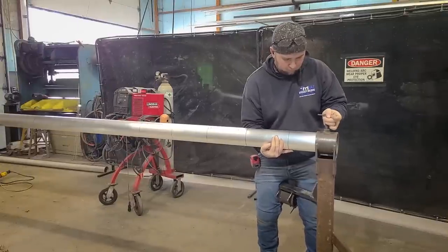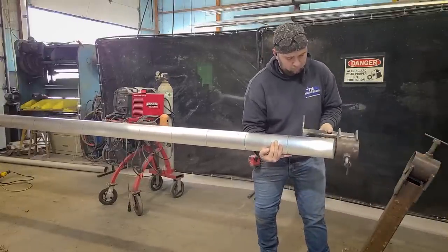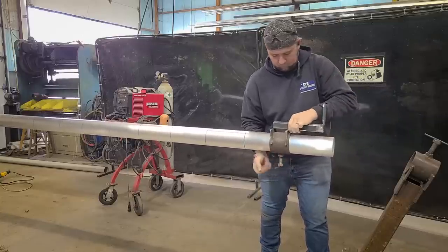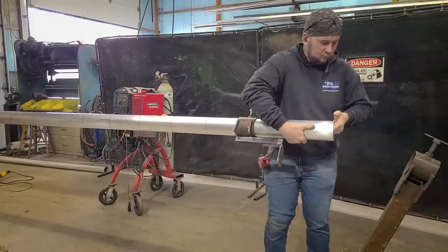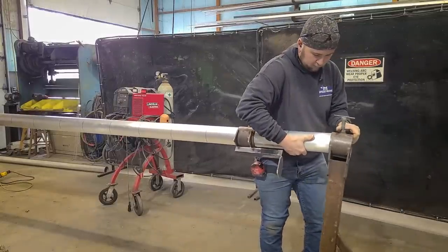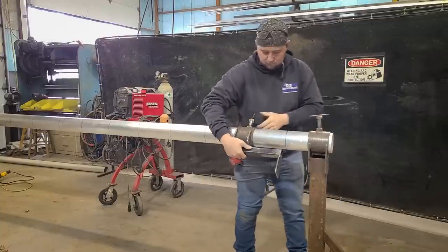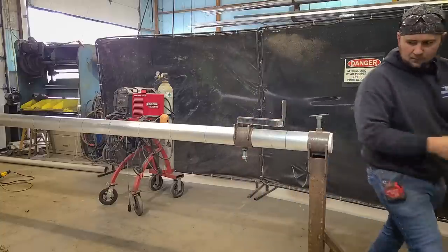Next, we put on the tread holding tool. This tool is specially made for holding the treads in position so that you don't have to fumble with them. It's not a foolproof tool, but it gets you pretty darn close to being level and plumb. It's made from a piece of pipe with a locking nut on the bottom that'll hold the treads in any orientation. Now, they don't sell this tool in stores, so you're gonna have to make your own.